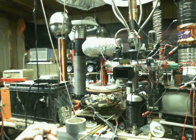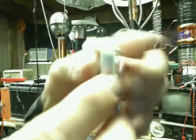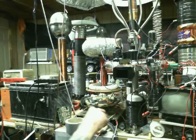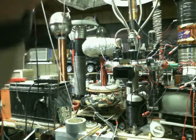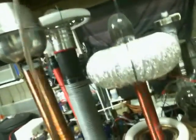I had taken and cut the condenser off. There's a couple little wires back up inside of there — I clipped those wires and took the condenser off. And up here you can see a little LED. Notice I got a little yellow LED right here and the little fluorescent lamp starter. I've got this cable right here running down so that I can touch it on the ground.